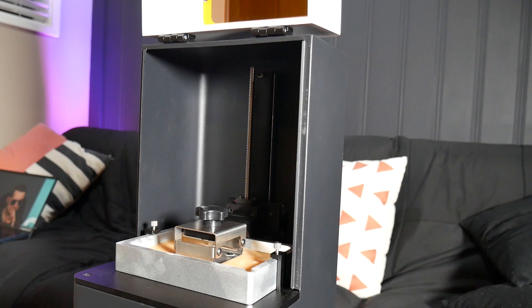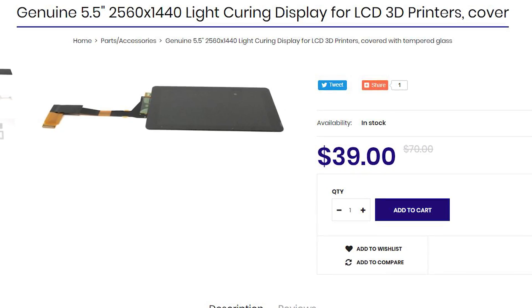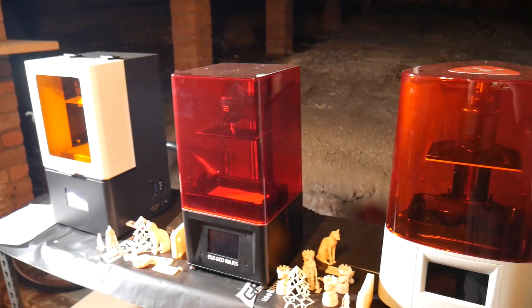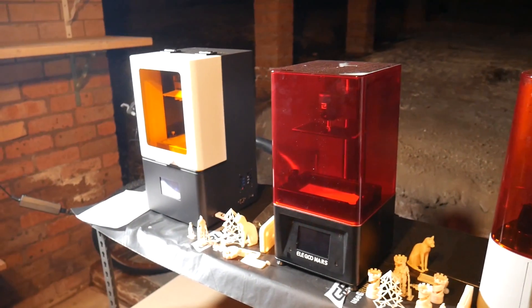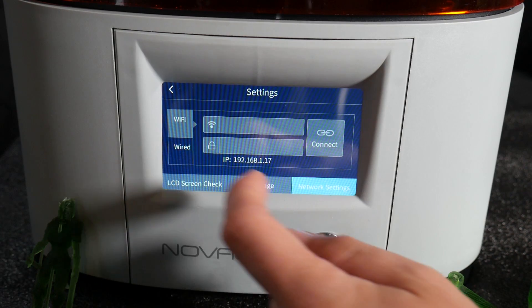As I do need to mention in these reviews: the film is a consumable and the LCD is a consumable too. You need to consider that it will degrade over time due to heat exposure, and any debris in the vat, if you try to print with it, will destroy the fragile glass. Of interesting note, neither machine has Wi-Fi, which will make my imminent review of the Nova 3D Elfin somewhat of a spanner in the works — so subscribe if you don't want to miss that one.